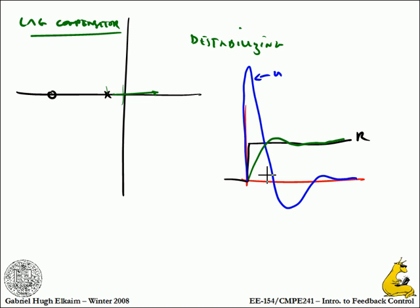Okay? Now, this works. But suppose in real life my actuator saturates right about there and there. I can't go any higher than that. So what am I going to do? Well, the easy thing is to go as big as you can and rail at the saturation limit. Since I want to give it more U but can't, the next best thing is to give it what I can. Now, what will happen is, as it comes back, it'll hold a little longer, because this will slow down a little bit. It'll hold a little longer there, and then it'll come back down.